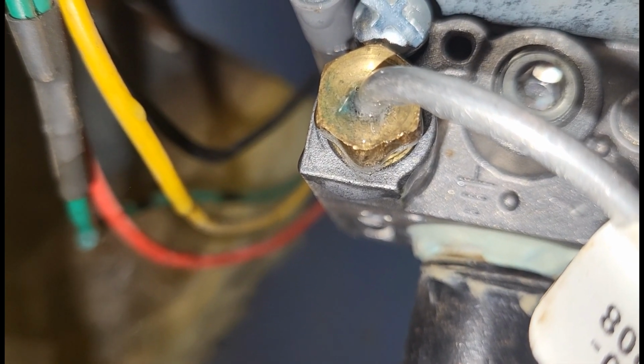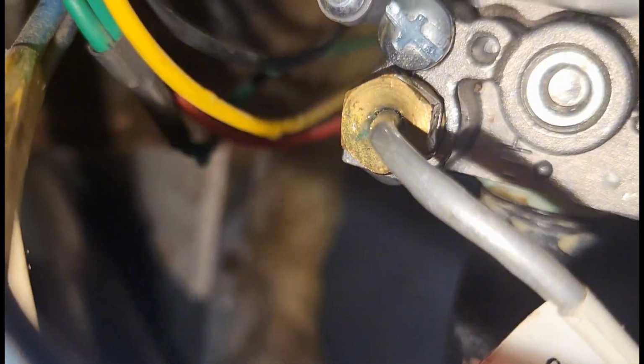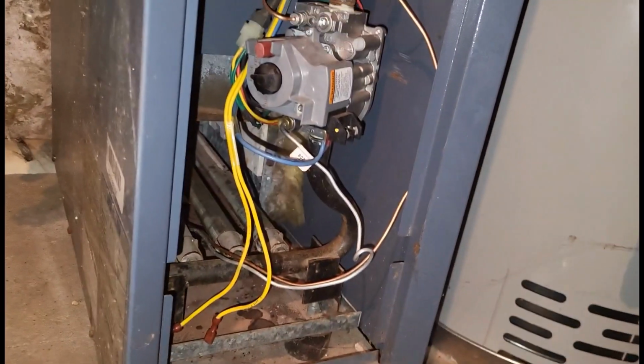And even after I turn it on, I'm probably gonna wait a few minutes after I turn it on to make sure all the pipes heat up. I can always still come back to this in like another 10 minutes as well. So guys, like I said, that's the cheat code. It's not like I'm hitting this only one time with the soap bubbles and leaving. You will always have ample time. Like I said, if you do it right, get everything connected early, hit it with leak detector. And if you don't have any immediate leaks, start cleaning up, start turning the boiler on, and you can always come back to see if any new bubbles formed after like 10-15 minutes. So, and also while you're doing your paperwork as well.